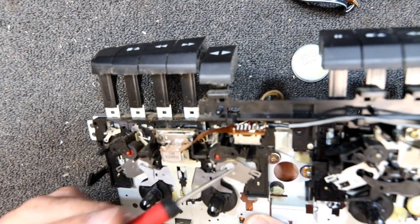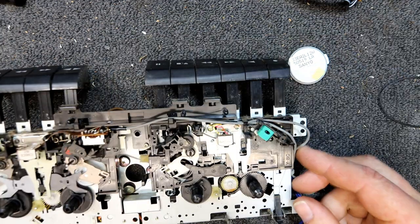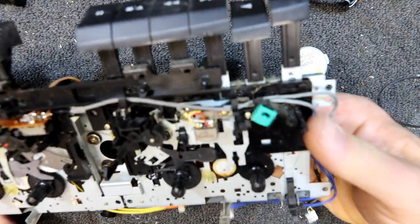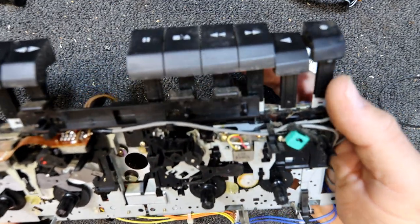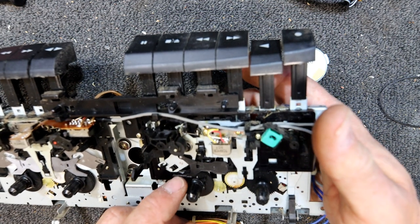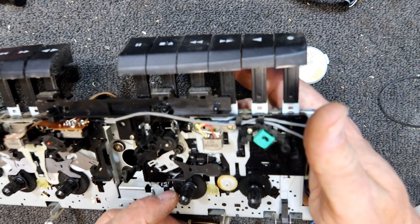Yeah, then you can see this lever move across. Hopefully that's actually on camera. And that's it. And that's our 1021Z. Just got the normal little oscillating bit. Where's our capstan? Yeah, that's going the right way. As long as that reel turns, you can see this bottom part of that pin's pressing. If I turn it the other way, like we're in rewind, the other part of the pin presses on this bit. Quite a clever little design, but if I push this thing out of the way, even though the reel's going, it almost instantly stops.